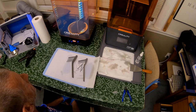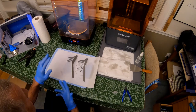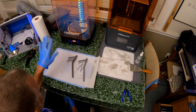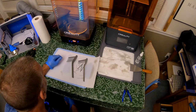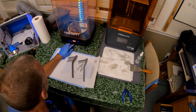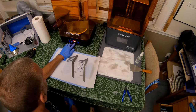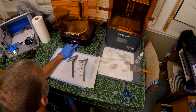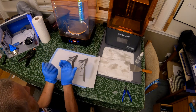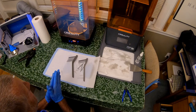So now I've got it in curing mode. Basically what it is — you've got UV lights, you've got a little rotating platter, and this is going to spin around. I'll do it for five minutes, then I'll rotate them because the insides might not get cured as much. I'll bring you back when that's done.